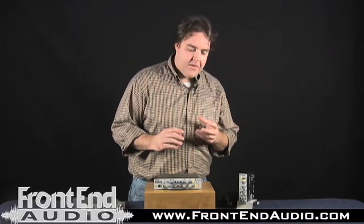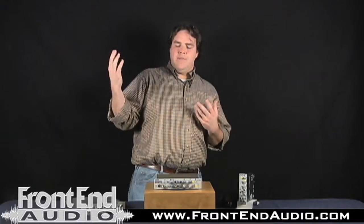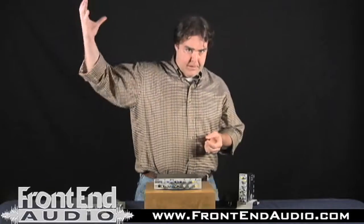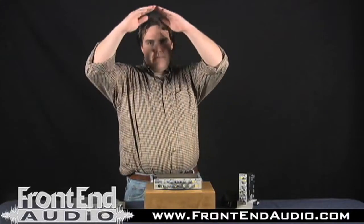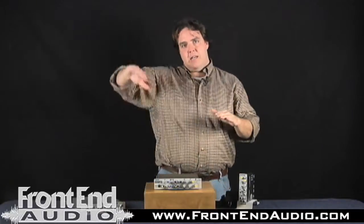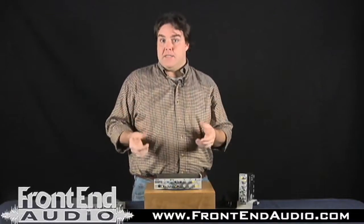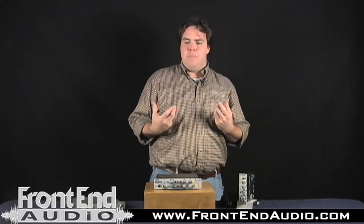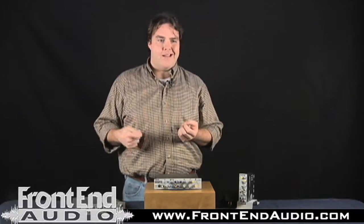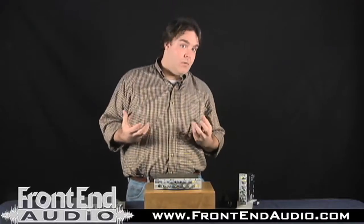The thing with that, though, is that with shelving EQs and so forth, even lots of gain on a bell curve EQ up beyond the range of human hearing, the slope of that dips back into the audible range. So really what you're doing is gently lifting the air range of the EQ. So it's something that really kind of opens up the sound without really generating a lot of boost in some of the more ice pick in the eardrum kind of frequencies, down like 10K, 11K, 12K, somewhere in there.